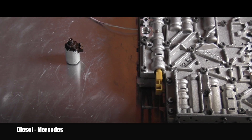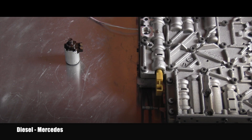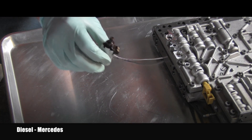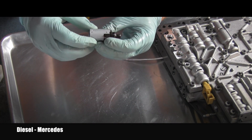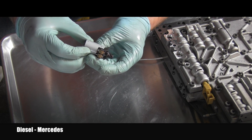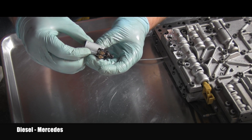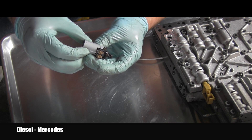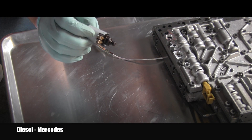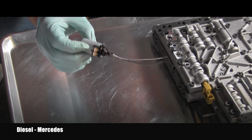I'm waiting for the part, so I decided to go ahead and check the solenoids for correct electrical function. What you see here is one of the three shift solenoids which are part of this automatic transmission. The Mercedes-Benz number is A1402770535. These three solenoids are interchangeable, so you can switch them around. Let's see how they can be tested.